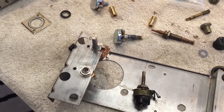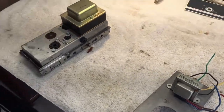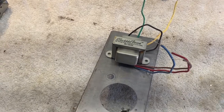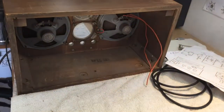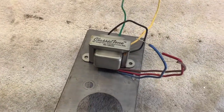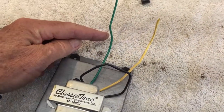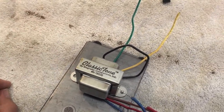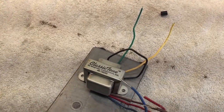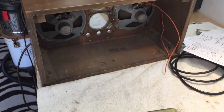Have patience, keep at it — it's a highly creative process and sometimes the results can be really rewarding. I tested the output transformer that came with this little amplifier and it had a winding ratio of 40 to 1. That makes it unsuitable for this matchup — it would be suitable for a 2 ohm draw on the speakers. I wanted more flexibility, so I've got the Classic Tone transformer here which has a 4 ohm and an 8 ohm tap. I'm going to have a single 6V6 power tube, looking for about 5000 ohms on the tube side and 4 or 8 ohms on the speaker side, and I'll make it so whoever plugs into the back of this has a choice of 4 or 8 ohm.